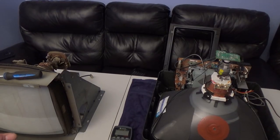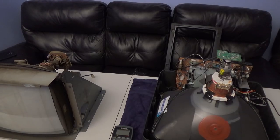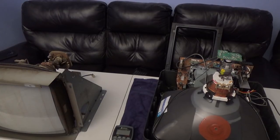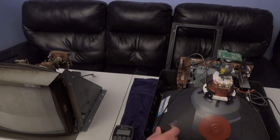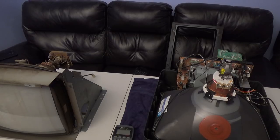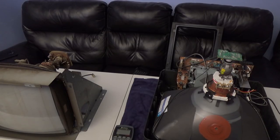I took the monitor out and it's sitting here. Not always, but most of the time the bolts are 3/8 or 7/16, so I've got my open-end wrench and socket driver — that fits and that fits. Now the question is: how do you know which tube is a good swap for your existing tube? Well, despite popular belief, you really don't have to go by the model number on the tube.